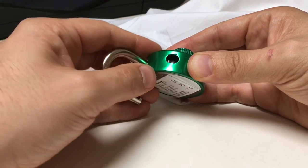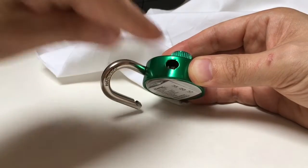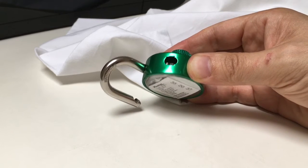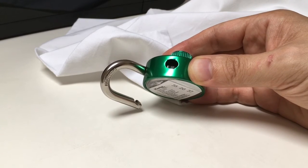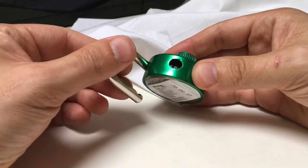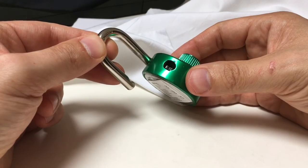So if you do try and stick a shim in, you can't move it around to push the pole back. If you put a shim in here, it digs into the grooves, these little grooves, or teeth if you like, on the pole. And that stops you from pushing it down. There are videos of somebody successfully shimming this using a strip of metal from a bean can or something similar, a soup can, which does work. I want to try that out, and maybe if I do, I'll post a video demonstrating that that method of shimming is correct.